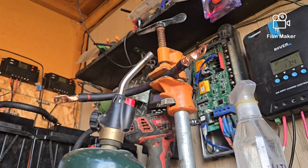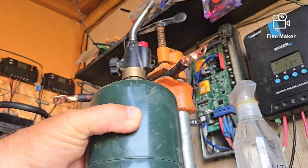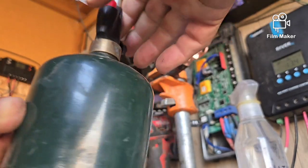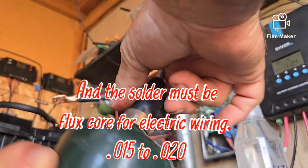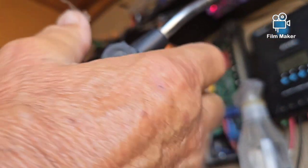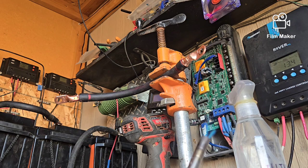You're going to need one of these little torches. You can buy these at about any hardware store — the little propane bottles, you can get the chubby ones or the elongated ones, it doesn't matter as long as it's propane. Always unscrew these when you're done using them, otherwise they'll leak gas and you'll come back to an empty tank. Now I'm going to crank this on, and we don't need a super hot flame so I'm going to turn it down a ways.